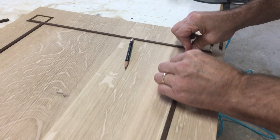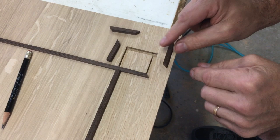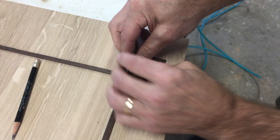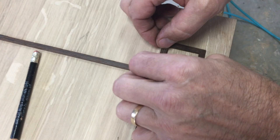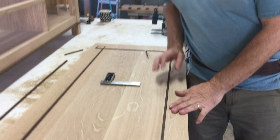Here are some little pieces which I've cut — little miters — and these will just fit nicely like this. These are pieces I cut earlier. Then this one shows the line jumping over that one, so this one has a butt joint here and a miter joint there. And then when that's all done we go all the way around the piece and all of this gets flushed off. When it's finished, with any luck it'll look something like this one.